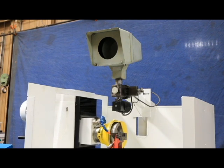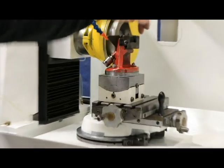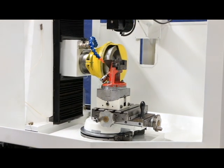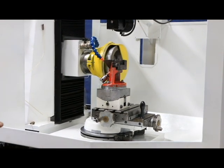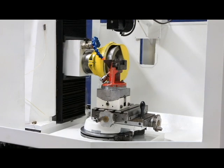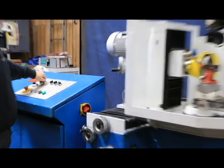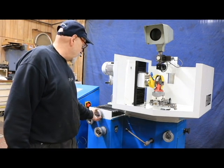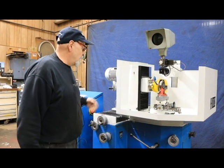There are a couple of accessories that you can clamp a workpiece with. This is a little channel here that's got some set screws from the side where you can clamp in a tool post, a tool holder right off of a lathe. This comes out of here when you unloosen the clamp. There's also a holder which holds a type of collet. So obviously here we have our spindle and we have a movement that goes in and out. There's also a faster movement, and a finer handwheel here to give you an even finer ratio to move this.